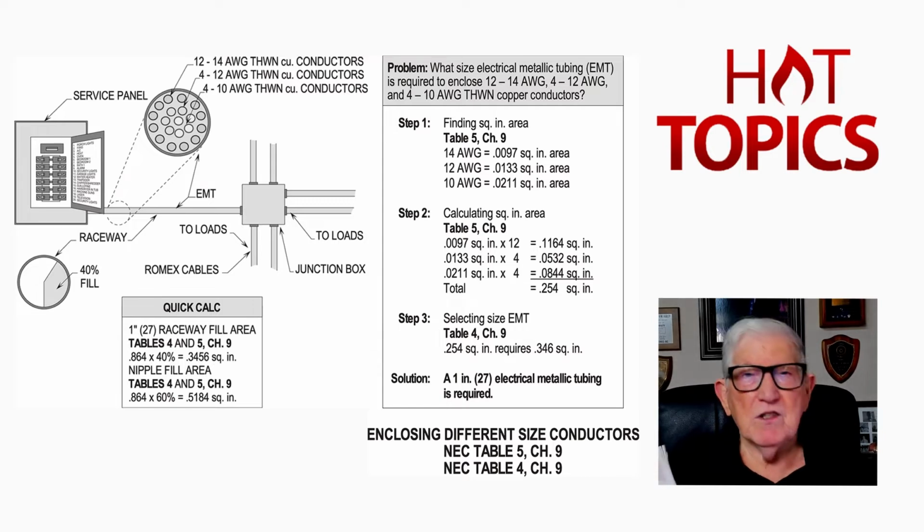So going over to page 160, left-hand side of your page now, the section to determine when a neutral is considered current carrying is 310.15(E) as in Ed, and it's item number 3. And on a Y system, if you're carrying more than 50% of the neutral current in harmonics or nonlinear loads involved, and you know, we always use a simple illustration. If you had 100 amps on L1, L2, and L3, and if you had 51 amps or more of harmonics and nonlinear loads, then the neutral's current carrying. But if you had maybe 48 amps, no, because you're not 50% or more, see. So we pick up that rule there. In fact, we pick up the neutral conductor along with 220.61 around page 79 of the code.